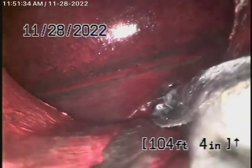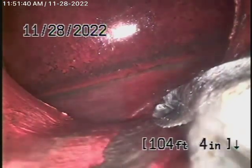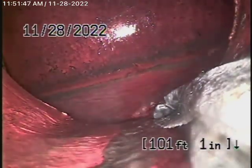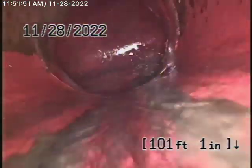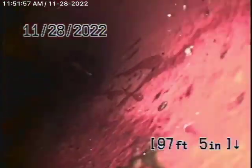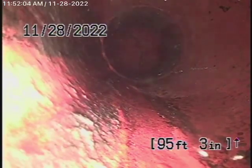There's the city sewer right there. You can see it flowing by. We're going to bring the camera back from here — there's the city connection. Looks like there's a rag in there, or a piece of paper or whatever. That's why we always recommend never to flush tampons, baby wipes, or paper towels.